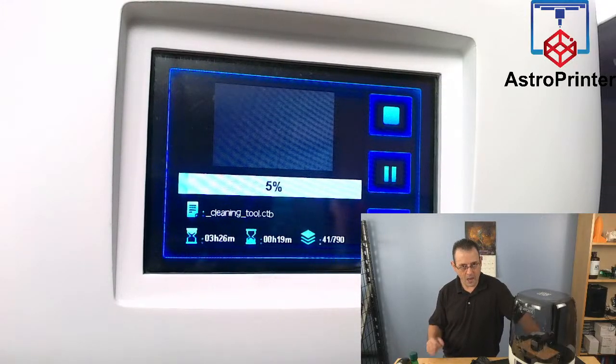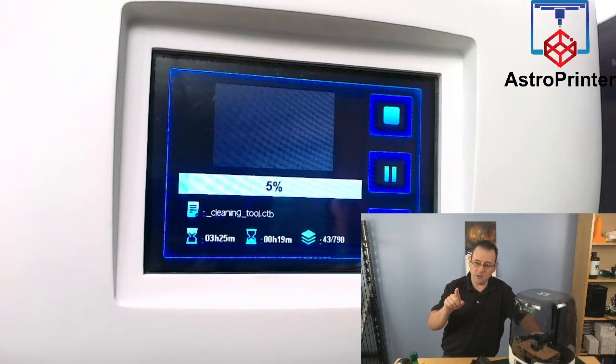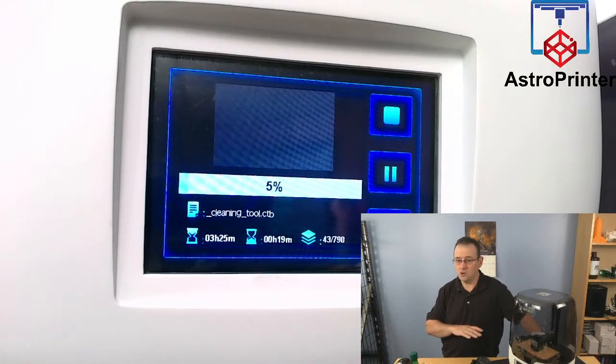I'm also going to consider turning my Creality Wi-Fi box into a Klipper box, which can also be done. You have to reload the firmware into it, but there's a way of doing it. I may even combine the Wi-Fi box with my Ender 5 Plus and have it as my Klipper controller. All with stock settings, all with stock hardware. No changes to the screen, no changes to the main board, nothing. All stock.